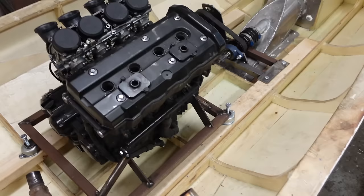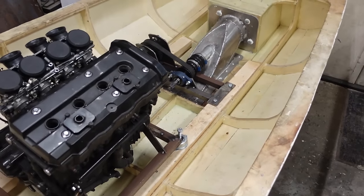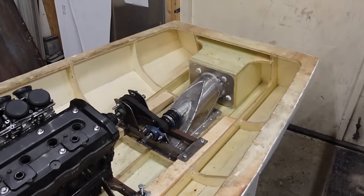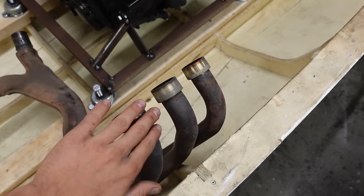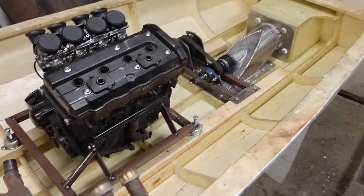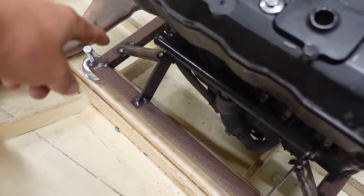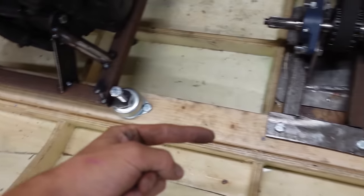But now it gets complicated because, as you might know, a boat or a jet ski normally has a water-cooled exhaust. And you know it because water is coming out of the exhaust port. So the reason why it's cooled by water is just because the exhaust will get really hot really quickly in here. So to solve it, they simply put water in the exhaust. So I'll just put four tubes spraying water into each exhaust pipe to cool it. And then the water will go in here.